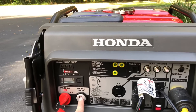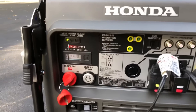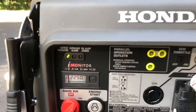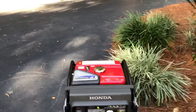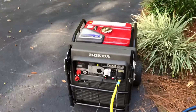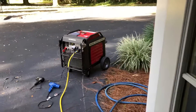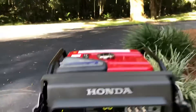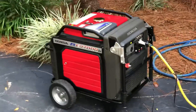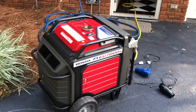Let's crank it back up. Okay, we're back to 2,400. So if we take all the load off of it, this is what it sounds like with no load. Let me flip this breaker and it'll take all the load off. There we go — that's no load. That's my little Honda fuel-injected 7,000, and we know that it will take the load.